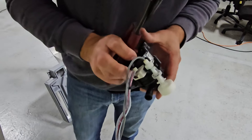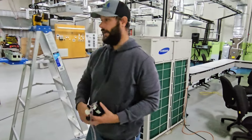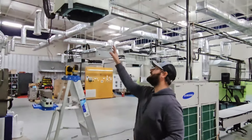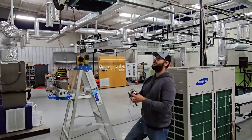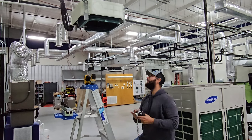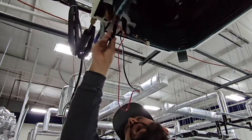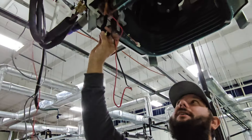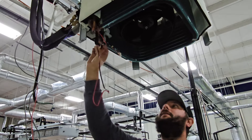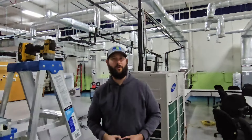You may have to take this pump apart — it's super simple. You just take a flathead screwdriver and pop these pieces right here. There's the impeller — you may have to clean that out. Whenever I perform maintenance on a four-way ceiling cassette, I not only clean the coil, I clean the pan, take this little pump apart, and then there's a tube right here. I put my shop vac on it and vac that tube out. This is how you take apart a four-way ceiling cassette.